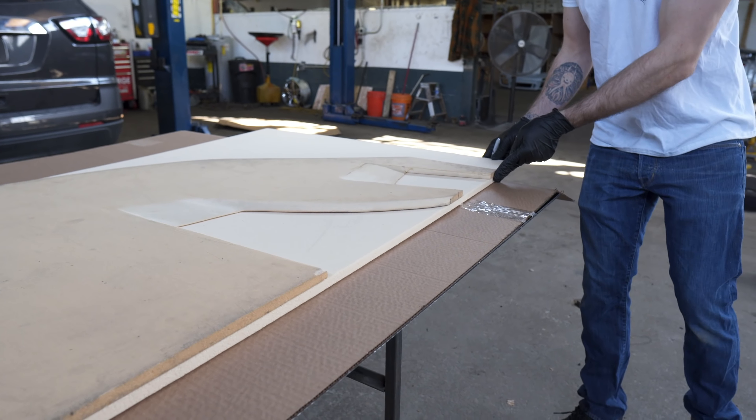So the other thing we've done — the top half is going to be carbon. This is basically going to be flipped around when we infuse it. The bottom half of the infusion, or the top half of the part, is going to be completely flat — that's why I haven't sanded any of these edges. The bottom half, since you want it to act like a wing element, you want the front half curved in to let a little more air flow underneath it, and the same with the back. I don't have much of a back end not taken up by scoops, and that center section is going to go right into the floor.